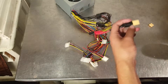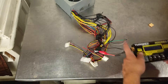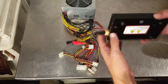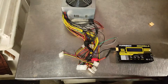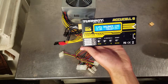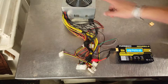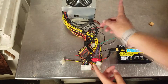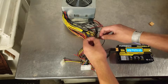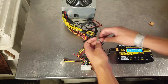Once you're done with that, you should find that this fits snugly right in there, and then all you have to do is start it up. It looks like we have everything wired correctly, so we're going to go ahead and turn the power supply on. As you can see, it works fine — 11 volts and 11 volts — and just charge your batteries. One tip: if your power supply does not turn on when plugged into the wall, make sure those cables are connected. I actually connected an extra black wire because these can be a little faulty — the black wires are just grounding cables.